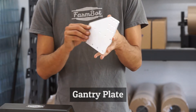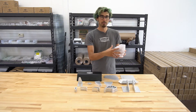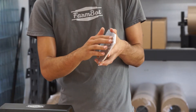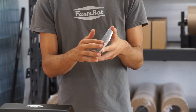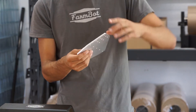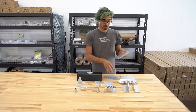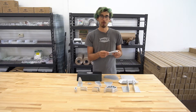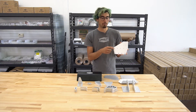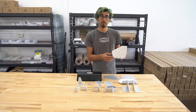The gantry wheel plates are used to attach the gantry column to the wheels, and the wheels will run along the tracks in the X direction. We have nine holes here which are used with M5 screws to attach the gantry column, and also a notch in the back to allow you to position the end of the gantry column with nice vertical alignment so you get the left and the right side of the gantry columns even. There are five holes for V wheels that ride on the top of the tracks and four holes for V wheels that ride on the bottom of the tracks.